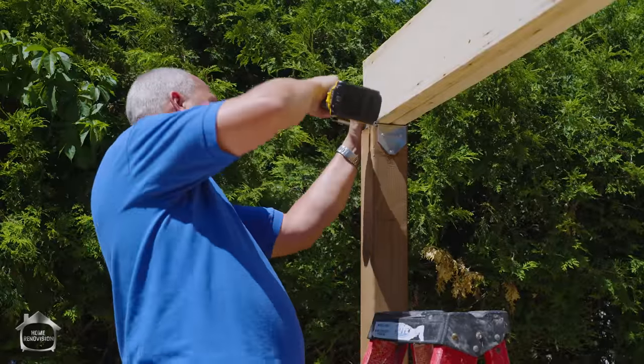The posts and the beams are like your skeleton, and the posts I'm putting in now are more like muscles — it's what everything else is going to get attached to. I'm going to put another door here for the lawn mower — going to 30 inches. Now for this post and beam construction checklist: we've got our posts, our beams, and these posts that facilitate hanging our horizontal pieces. I now have three doorways secured. We want to fill the rest of this area with horizontal boards so we can start sheeting, and then once the back and sides are sheeted we can add our interior wall. This is coming together so quick.